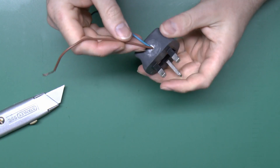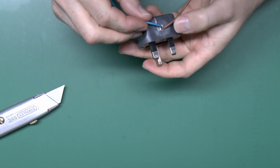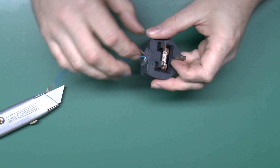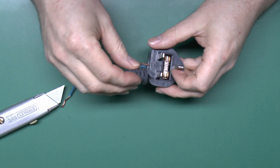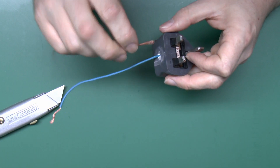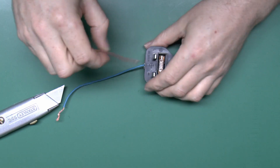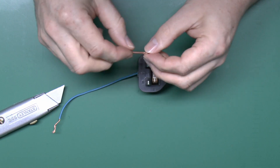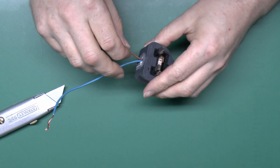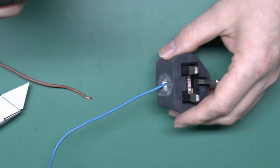So we'll see if we can cut into this and see what's happening inside. Right, just taking that cover of the cable away, and this doesn't look to be damaged at all here, which is quite surprising, as we would expect the damage to be in the flexible component there. But well, there's the problem — look at that. So it's not actually in the wire itself; it's just apparently not attached to anything inside, so very surprising that it just pulls out like that.